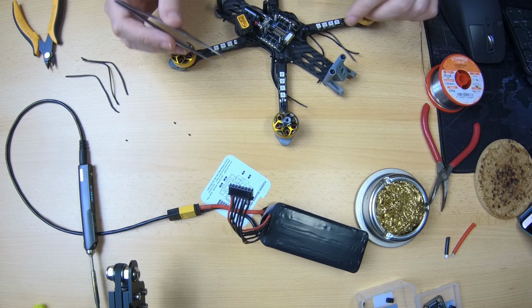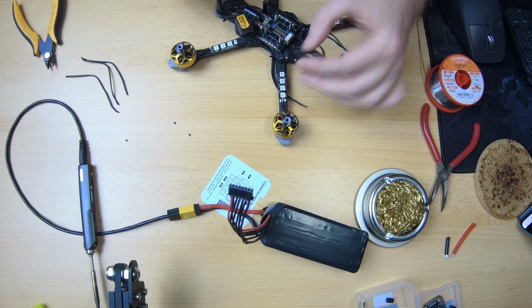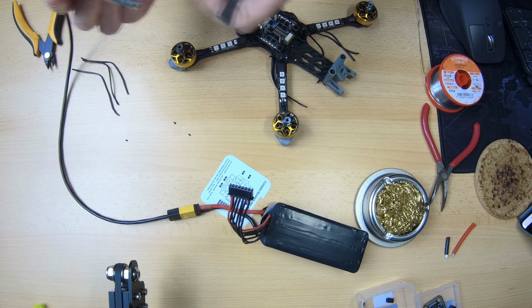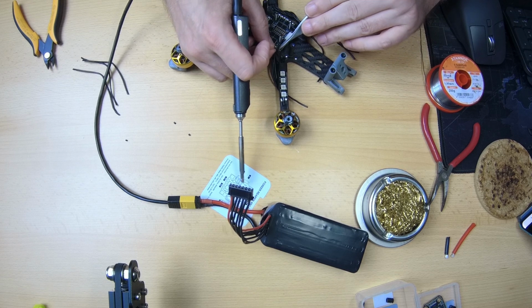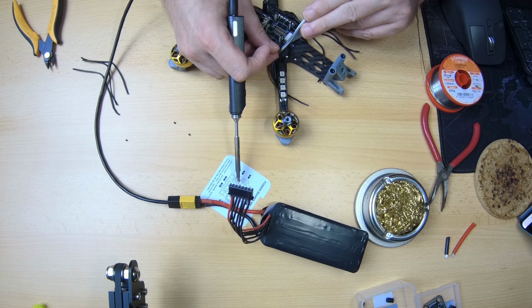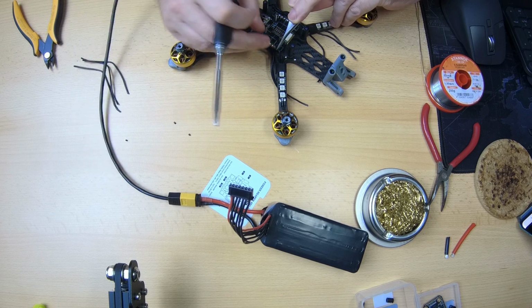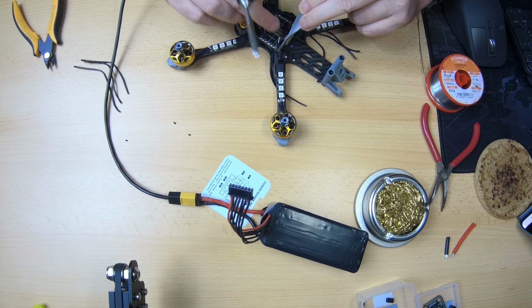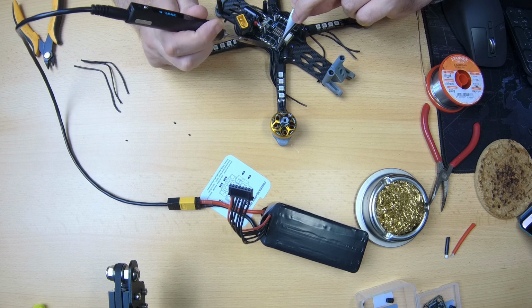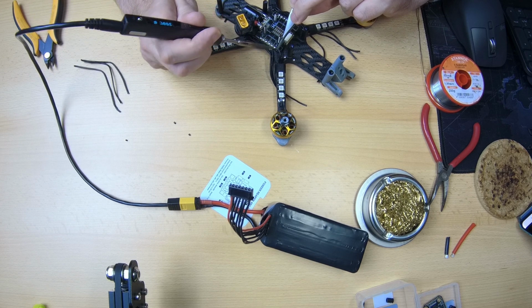Okay, so the first, this motor wire, the one on your left, this one will go to the first pad over here. I have decided in my infinite wisdom. Yeah, okay, so first make sure you can actually reach things comfortably before you go and commit to the solder job. Just check if something maybe is in the way, like the bolts or the plug or electronics on the board itself. Then set it in place and solder it up.